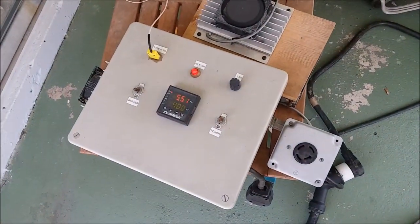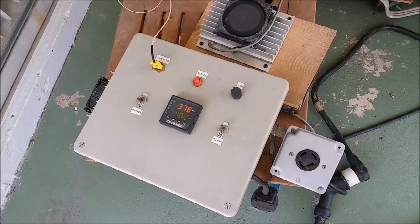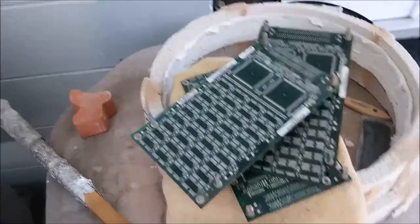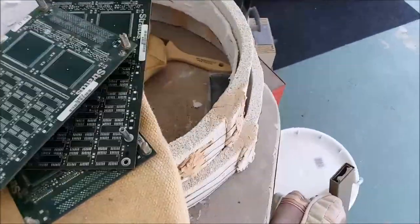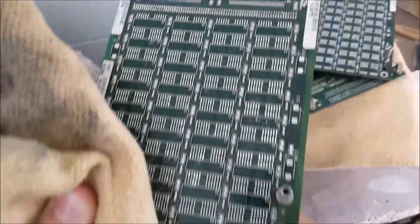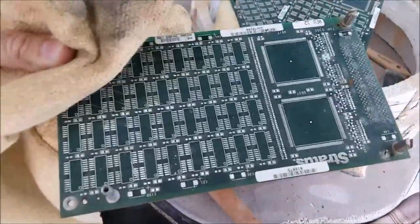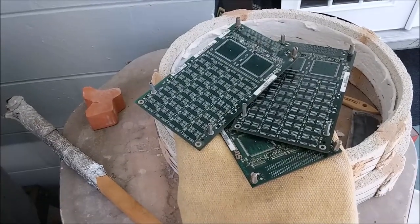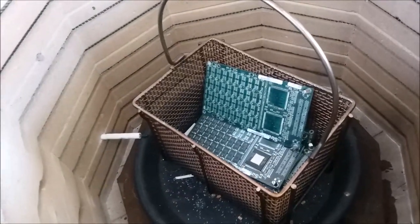It's working good. Temperature came down a little bit by having the door open, so I'll let it come back up and soak in the heat for a while and then come back and shake it again. I'll keep doing this until the boards are all depopulated. I just gave everything another shake and I pulled out a couple of boards that are completely depopulated. Absolutely everything has fallen off - the connectors, all the ICs. This is really working well. I'm starting to wonder whether I need to bother building the trommel depopulator.